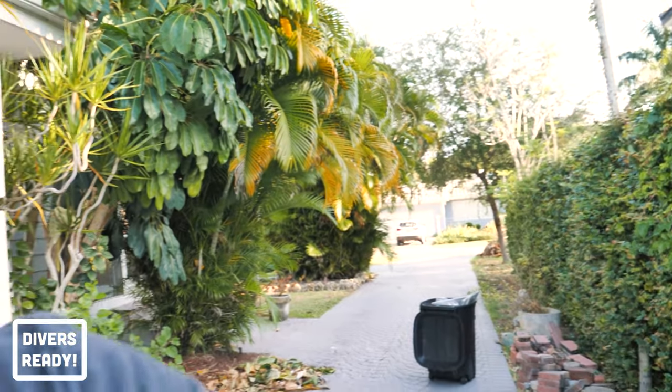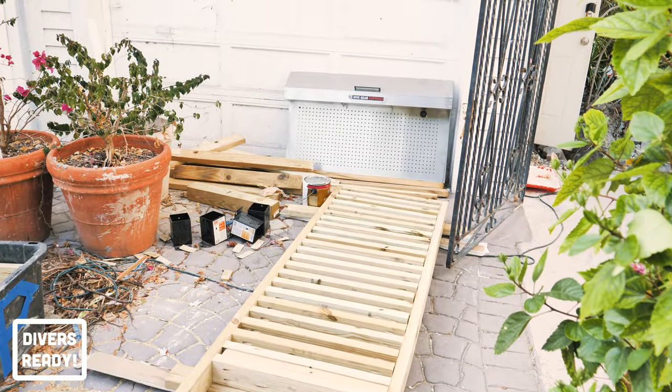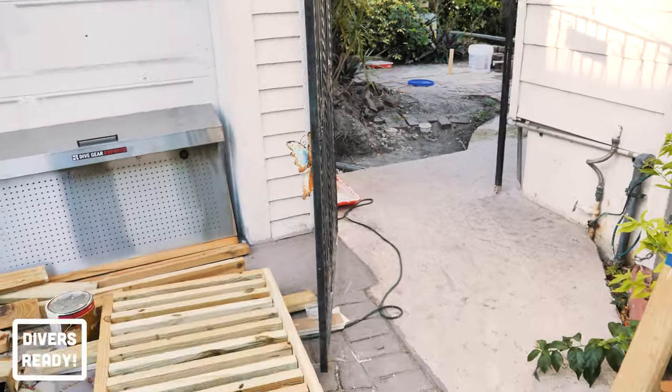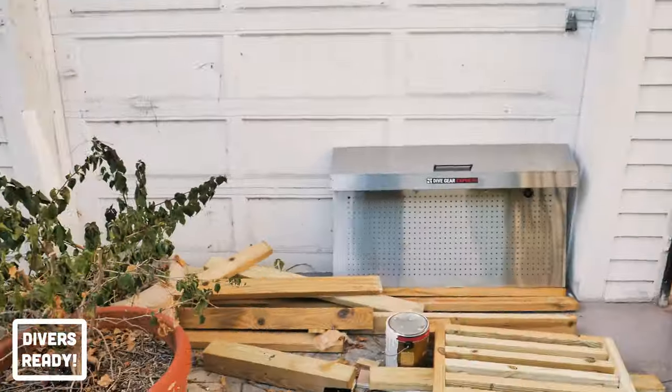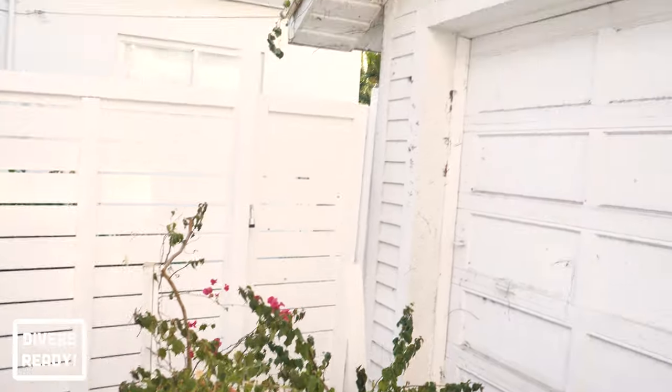Next I've got to take you guys outside because a lot has been changing in the outside portion, which I really didn't talk about too much in the first video. So if you remember before the tenants moved out, I walked up that long driveway and we've now created this fenced-in area — basically a little outside compound. We're going to start building out some workbenches. Essentially this is going to be a drainage board slash workbench slash drip table. The idea is to put a hundred-gallon rinse tank plumbed in next to the hibiscus bush, and then this workbench is going to be mounted to the inside of this fence about 42 inches off the deck, reinforced by 4x4 footings — probably two shelves top and bottom. It's going to need super reinforcement but that's very much my style to over-engineer everything.